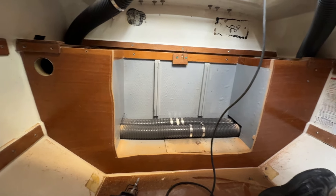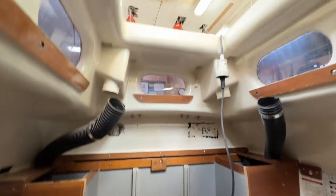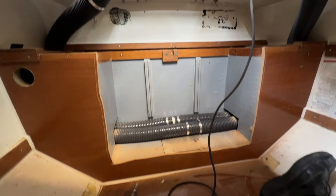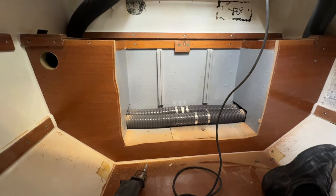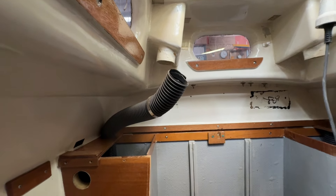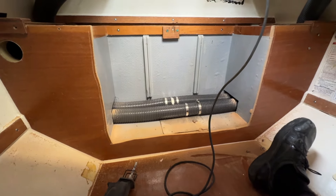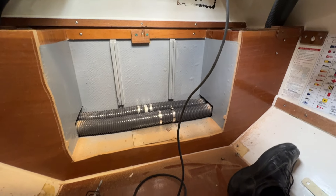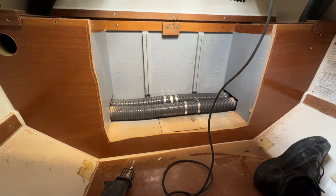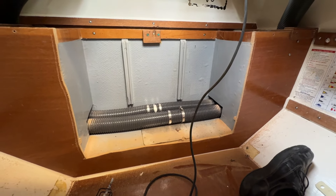This is the start of opening up the bulkhead here and closing this hatch because this pad is going to be dry — this is the ventilation system. It's really too big, taking up too much space, and it's a mistake because water can collect down in the bottom if it comes in and then won't go out again, locking the system. I didn't realize that 35 years ago.